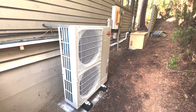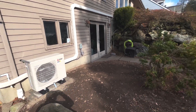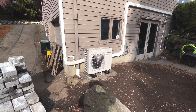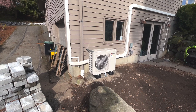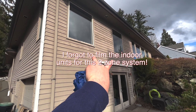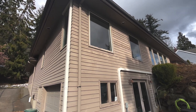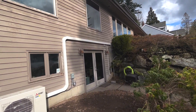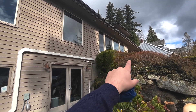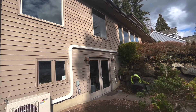Here we are at the view-facing portion of the home. We have our Mitsubishi 2C20, and essentially what we're trying to do is deal with the cooling load along all these windows. These two windows are in one room — we've got a 9,000 BTU GL head for this bedroom. Then you can see our refrigerant lines running here, and we have a 12,000 BTU head to deal with this big sewing room in the front.